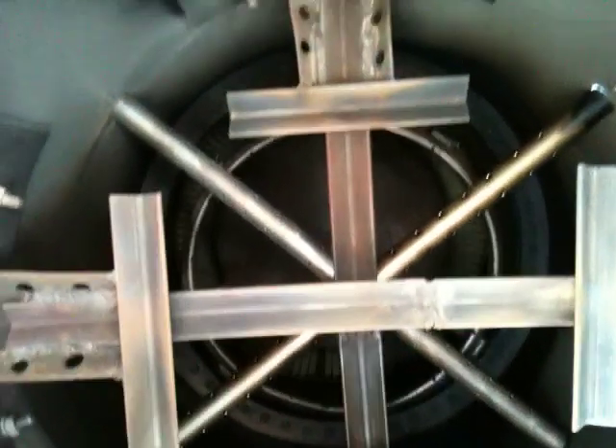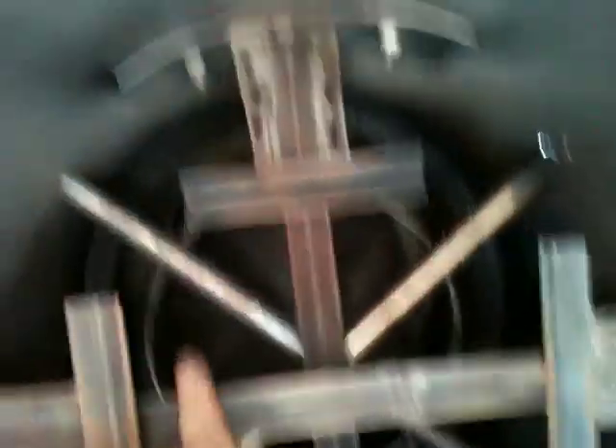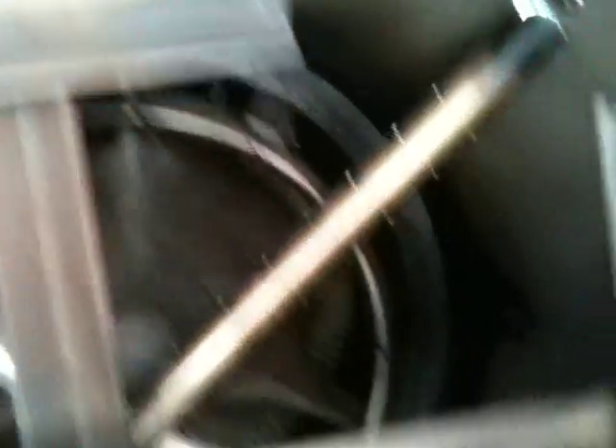You'll see the flame holder is the first section we've come to, and then you'll see the spray bars right behind that where they cross over. Going back a little further, that round ring down there is what we call a lollipop. It's drilled with holes all around so we have good dispersion — a perfect flame holder. Remember, everything is designed to allow for expansion.